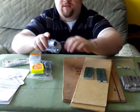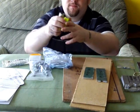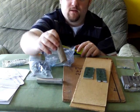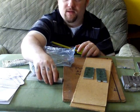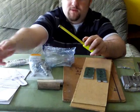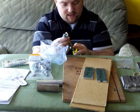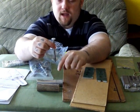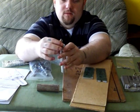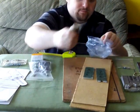Then we're going to need some stuff for the pump handle. You're going to need a little bit of tubing — can be steel, can be aluminium — and that needs to be at least 4 and a half inches, any kind of roundness as long as it fits in your hand. You're going to need some kind of wood that will fit inside that to fill it up, about the same length. You're going to need a bolt that is 4 inches — this is to hold the handle to that bottom plate — with a washer or two washers that are bigger than the width of the handle.